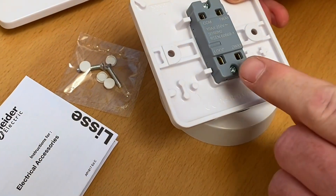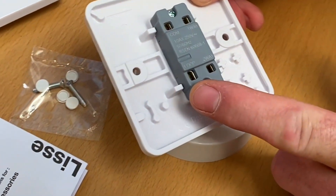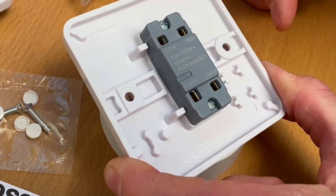Let's explore and see if this loop terminal is physically connected to any other terminals. We wouldn't expect it to be — if we're putting a neutral in here, and our permanent line and switching lines in these, we wouldn't expect them to be electrically connected together.